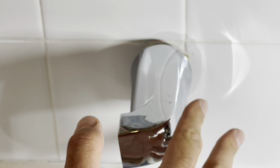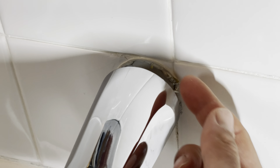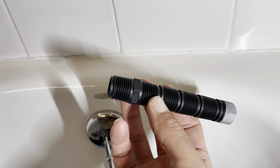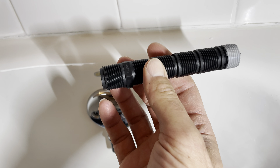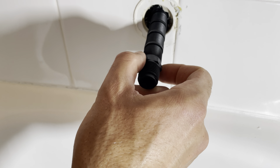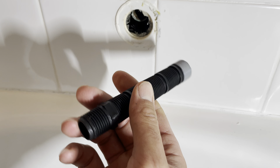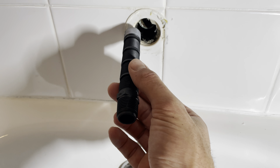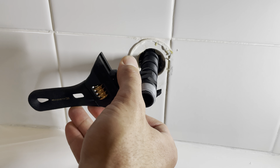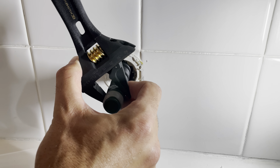I'm going to use two hands, screw it on, and see if there's a big gap — if there's a big gap that means we need to cut a little bit of the pipe. I got the piece cut to size. Notice I cut on the end that doesn't have the fitting, so there's still somewhere to put a wrench. I'm going to thread this in — and I highly suggest putting Teflon tape on here first before you thread it on, because it makes it a little difficult when it's in a weird spot.